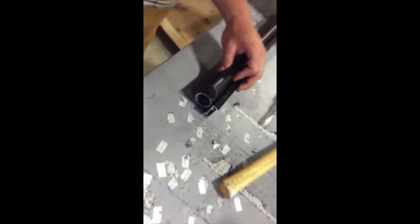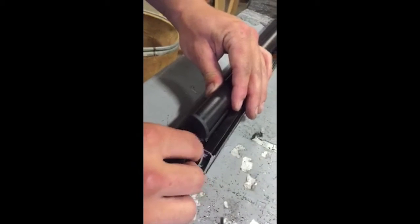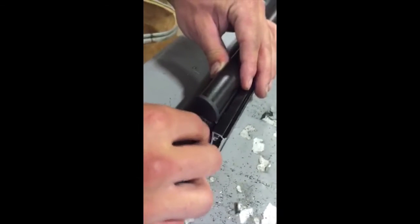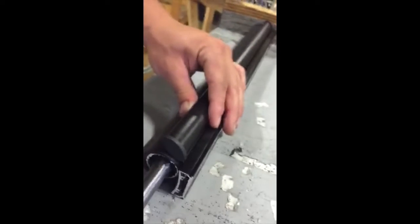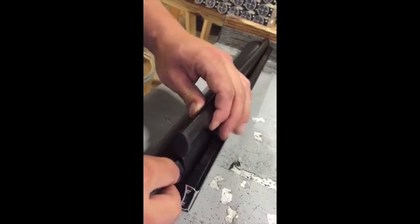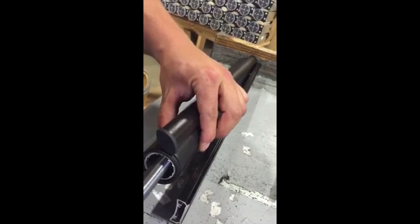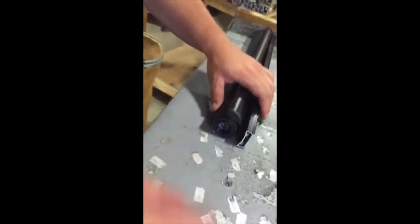We're going to put a new spring back in, lining up the six stars on the speed reducer, and then the tensioner lined up in the grooves. Go ahead and pick that up to show how it goes in, line that up, and then replace the end bracket.